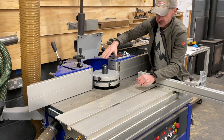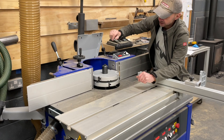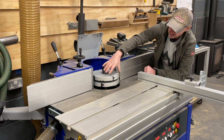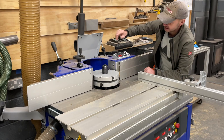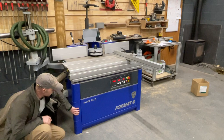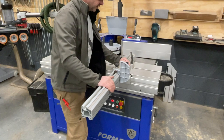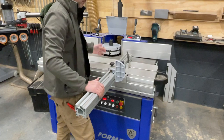There's no need to remove the hood for those. If you want to use even a 200mm rebate cutter, the cast iron bed still has a ring you can remove, allowing up to 320mm of tooling underneath — an absolutely massive disc. You can also opt to remove this and fit a swing arm more like a table saw. I've specced mine with the 1.1 metre cross-cut fence and a sliding bed for tenoning, which I'll show in a moment.